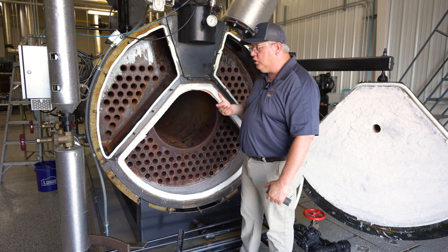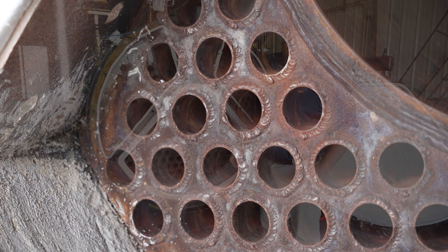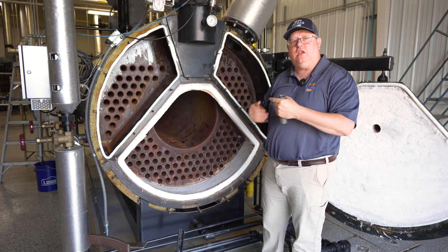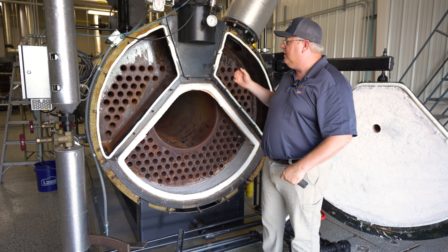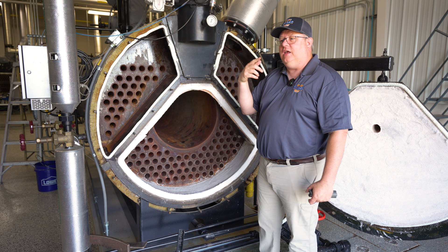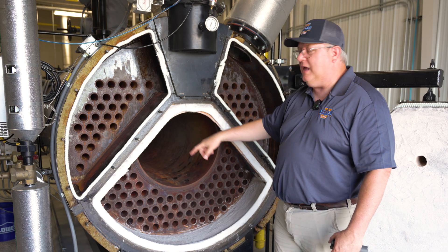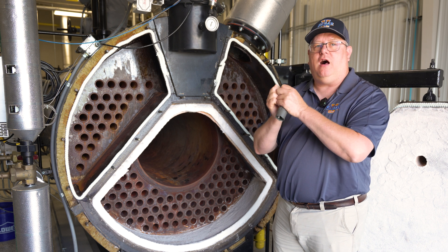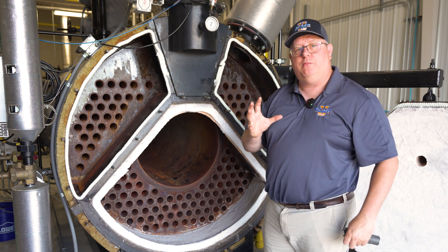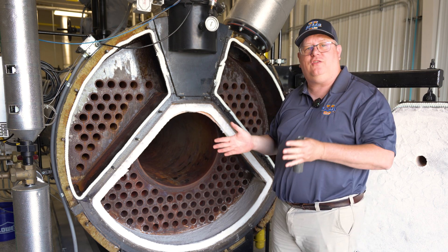The first example we're going to look at is a welded tube end. The idea of a welded tube end is not to form the actual pressure vessel seal. In all tube installations, the seal to prevent pressure, liquid, and steam from coming out is done by rolling the tube. But welding the tube end gives us a little bit better fixture of the tube, so it's less prone to move forward and backwards in the tube sheet with thermal expansion and contraction.